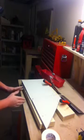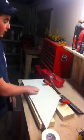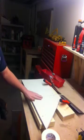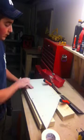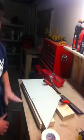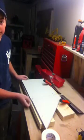Okay, so now I'm going to show you how to tape the drywall. After you have it hung, you can begin the process of taping. Now, this is a factory joint. Now, there's a difference between a factory joint and a butt joint. A factory joint, I like to call it a dimple in it. It kind of gets thinner towards the end of the piece.